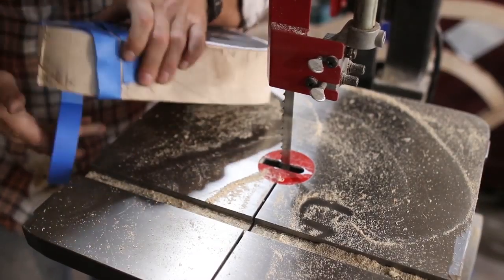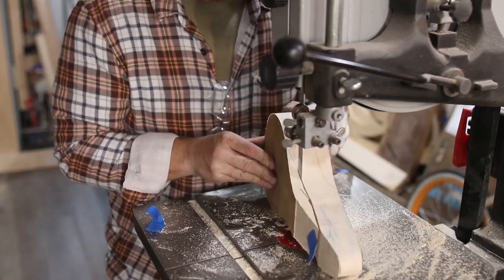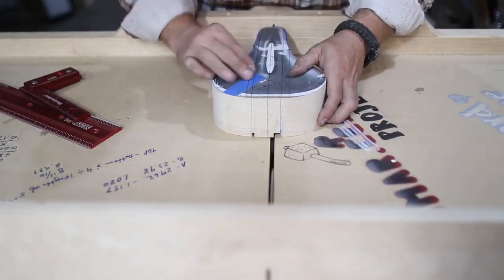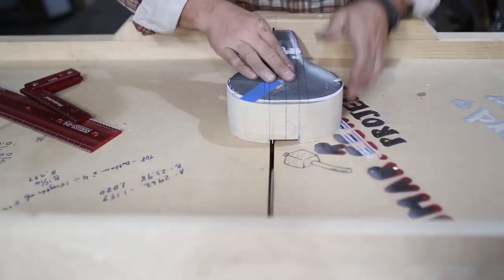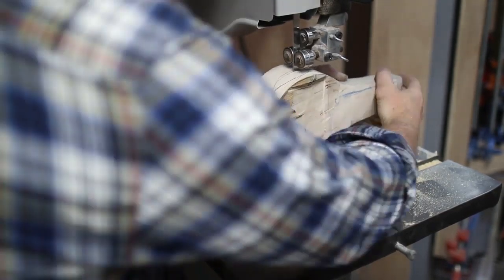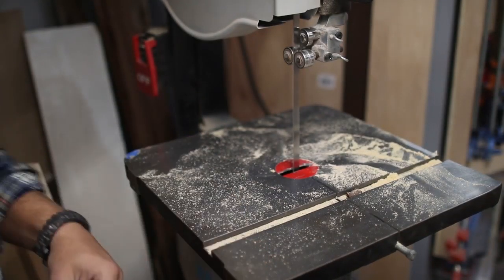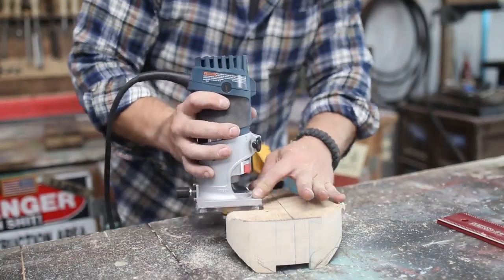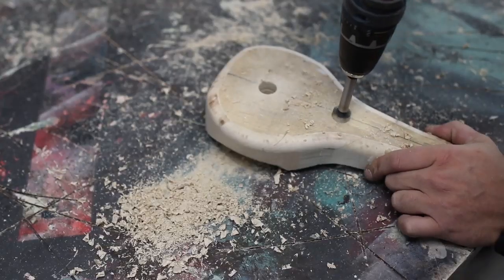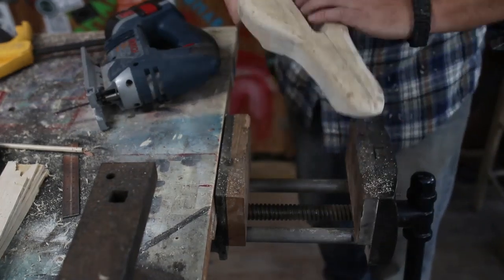It's kind of difficult to cut the side profile without a flat reference anymore, so I taped the cutoff piece back onto it, and that allowed me to cut it perfectly at a 90 degree angle to the blade. Over at the table saw, I cut a groove from the rear of the seat and refined the final shape over at the bandsaw. Then I could round over the corners with a roundover bit on my palm router. With a Forstner bit, I drilled two holes, and using a jigsaw I cut from hole to hole, creating that slit that I really like.